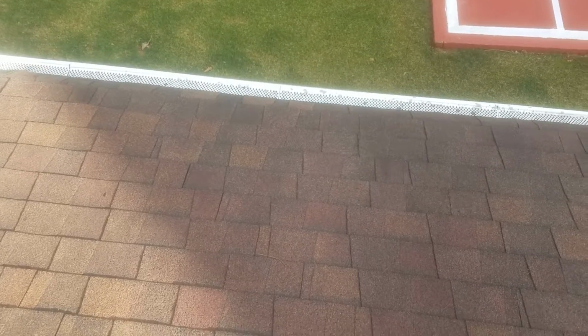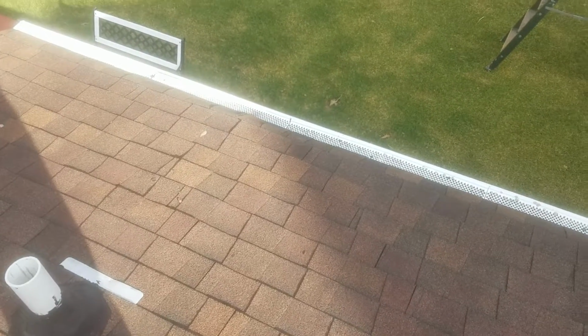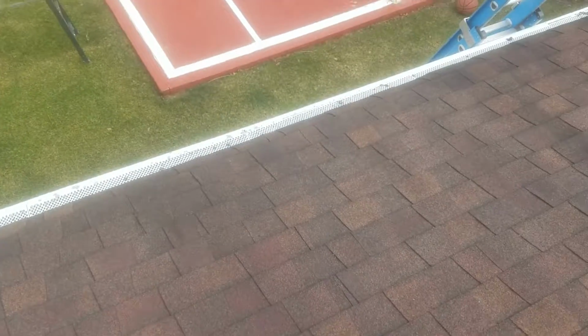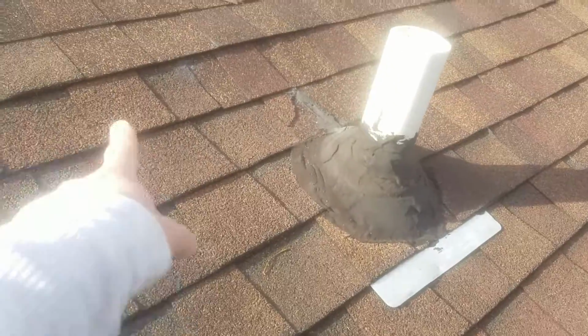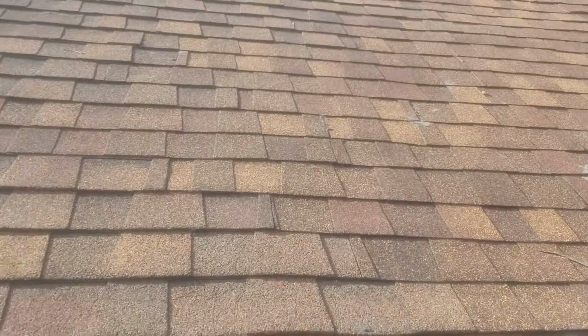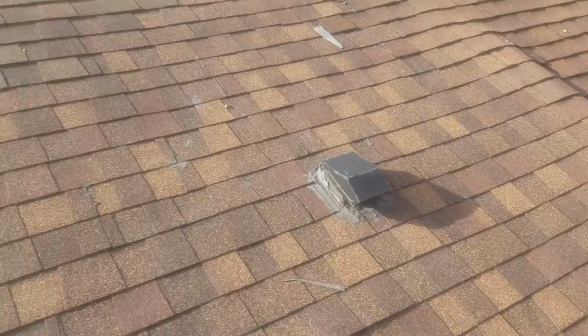The other thing that I would like to do when I do this is either pull the gutter or back the gutter out so I can wrap the ice shield behind it and put a drip edge on there for you, so nothing will back up from that gutter and get in there as well. You got a lot of nails popping and all of that. There's one here I'm looking at, a nail popped right through the roof. That's gonna leak on you. You got a lot of bumps from nails underneath popping out. That's happening kind of all over the place here. It's very wavy now, so I don't know what the plywood situation is going to be like underneath it, but definitely some of it has to get done. So that's basically it in a nutshell.